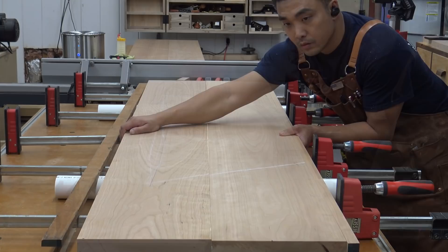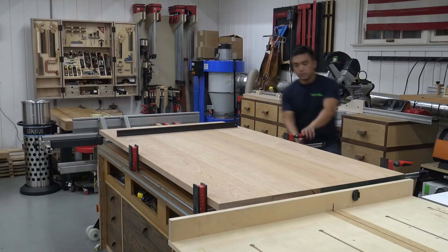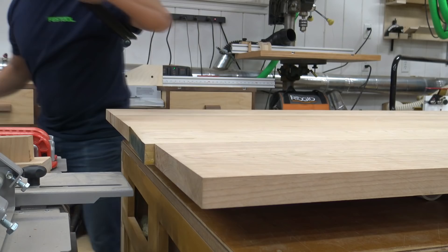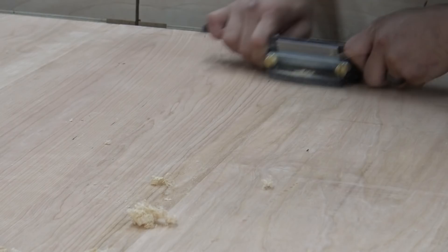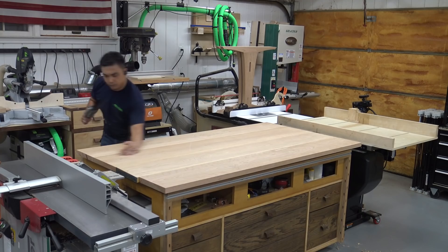I glued up the top in two halves, which made it a lot more manageable — two boards at a time, then glued those two halves together. I've used this method several times and while it takes a little bit longer, it eliminates the need for alignment joinery such as dowels, biscuits, or dominoes. If you did a good job of milling everything square, you should have a perfectly flat panel glue-up. Even after wiping off the glue squeeze-out, there's always a little bit of glue creep through moisture loss, so I'll wait 24 hours and then use a cabinet scraper to do a final cleanup of the glue line.